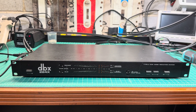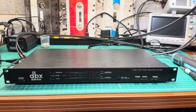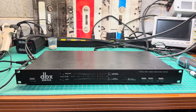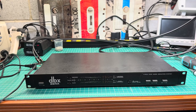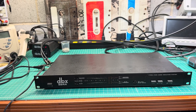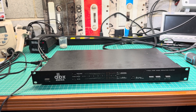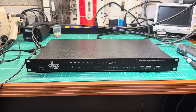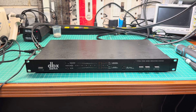Hello everyone. I bet you might guess what we'll be doing tonight right away. So what's happened? I remember my DBX box, the last one I got. It was sitting about a month and I tried to run it and it didn't run. After probably a couple minutes it started to run but it was starting very weird, crackling and then started to play, and then it was playing for some time and crackling again. My idea is that capacitors in this unit need to be replaced to make sure it will perform well. Let me open it and let's do it.